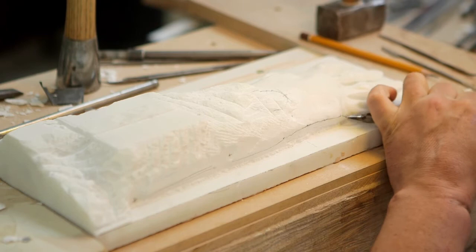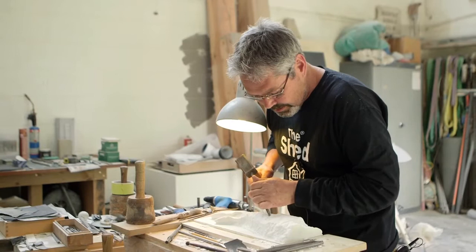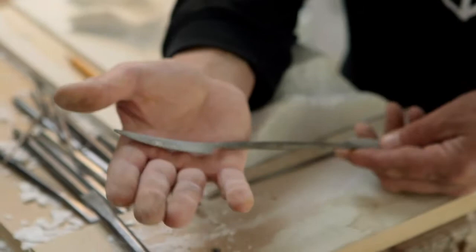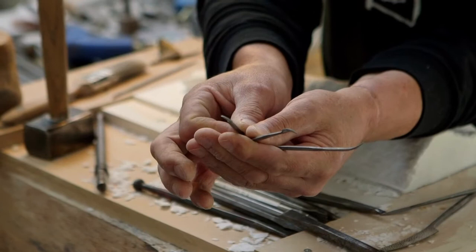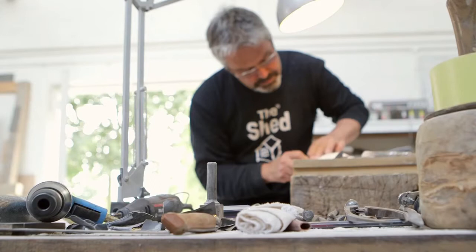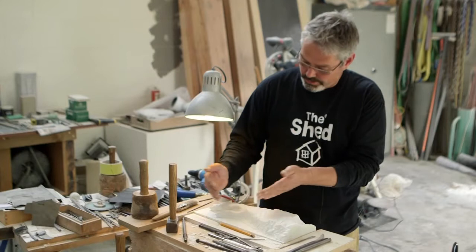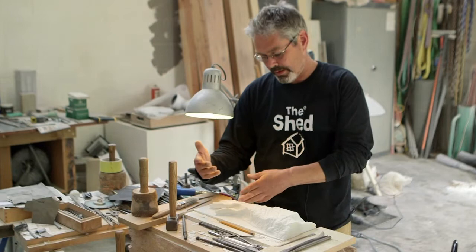Physically, if there's something on the surface that you want to delineate, this action is called chasing — it's what you do when you carve a letter when it's finished with a tool. This is a little shaped file called a riffler. These are die-makers' rifflers — they're files, not rasps; these are for metalworking really. Abrasive papers bring the surface and make it more reflective. When it's rough it's non-reflective; when it's smoothed, different surfaces start to play with light.